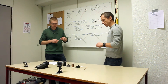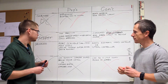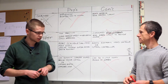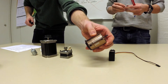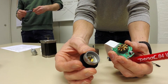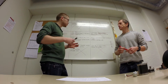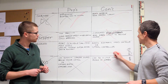So we're going with brushless motors. These are very nice and they're used a lot for gimbals — some are called gimbal motors. They come in a wide variety of sizes. This is a brushless in-runner motor where the magnets rotate in the center, and this is an outrunner where the magnets are on the outside and the coils are on the inside. You do need a special ESC — electronic speed controller — so that's an extra piece of equipment, but we can buy those controllers separately. It's going to give a lot more smooth movement than the servo, so this is what we have chosen.